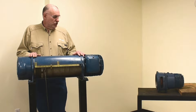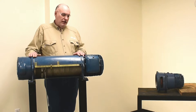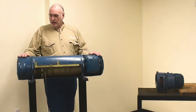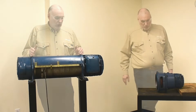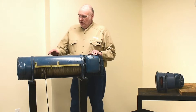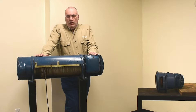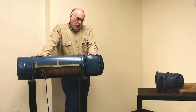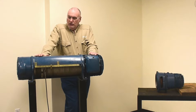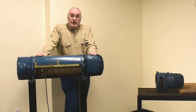The P hoist was introduced around 1961 to the North American market, and it was one of the first hoists introduced that would allow for motor removal or gearbox removal while leaving the hoist frame and drum intact on a trolley. There are hoists in the series from 1961 to about 1967 that have a two-digit model code. The major difference with those versus the ones made after that with three-digit model codes are internal — there's a different drivetrain and coupling, and you're going to find parts hard to get for the old early 1960s hoists.